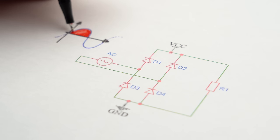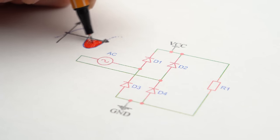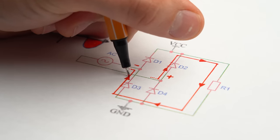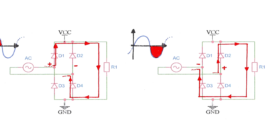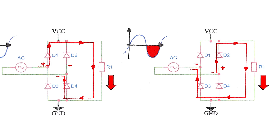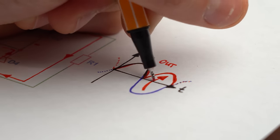When the AC mains voltage is in the positive region, we got a voltage potential that lets current flow one way. And when the AC mains voltage is in the negative region, we got the opposite voltage potential which lets current flow the other way. So in both cases a current flow through the load was possible, and what is remarkable is that the current direction was always the same — which basically means we folded over one half of the AC voltage and thus created DC.